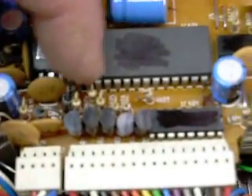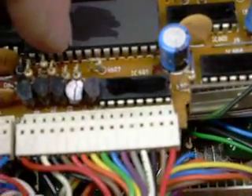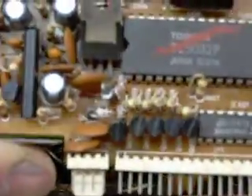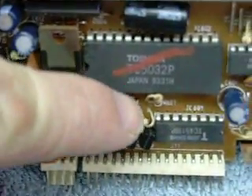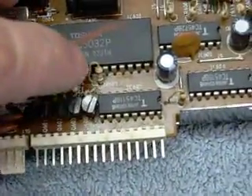So I'm going to show what I did on this module. Took these five resistors, shifted them over one hole. Took this last resistor, made a new hole. That goes to pin six of this display chip. Cut a trace that goes to pin five, moved it over to pin six, like I did on this one. There's the resistors, each now shifted over one hole with a new hole right there. Made my own jumper trace underneath.